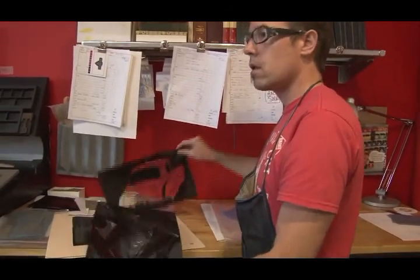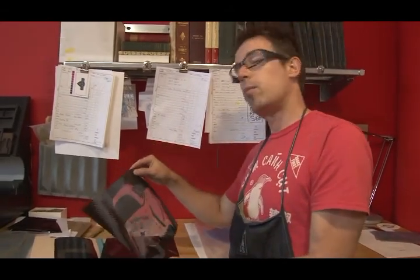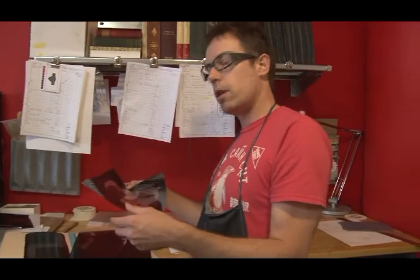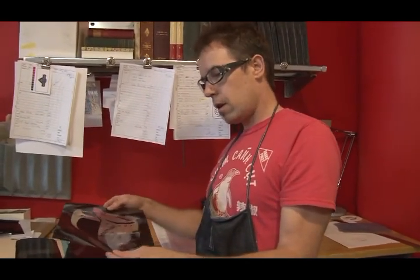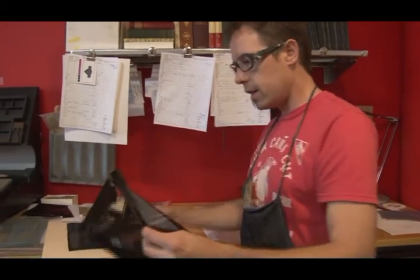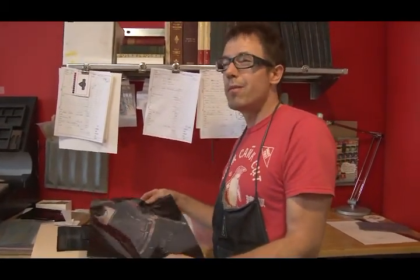So actually, this is the plate we're printing right now. Then I've got a plate maker, so this just goes down. The photopolymer material gets exposed to the negative, through the negative, to ultraviolet light, and then it's washed out and cured, and so all the fine detail is transferred to the photopolymer plate, similar to the way screen printing screens are burned.